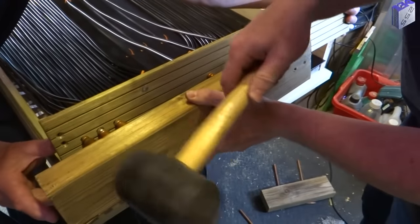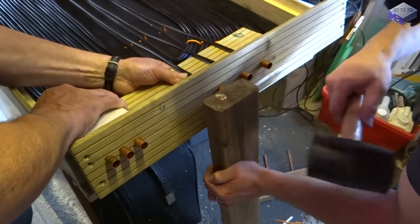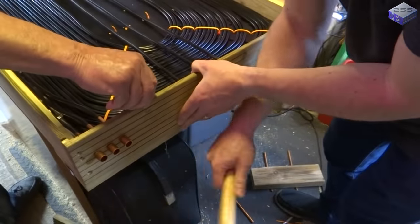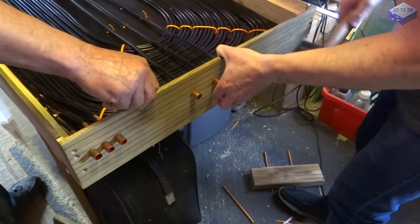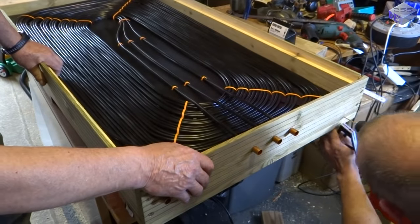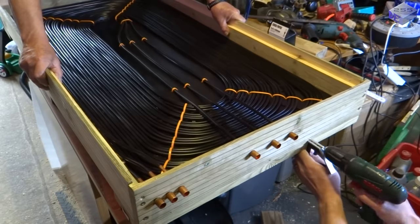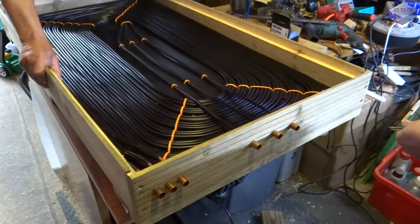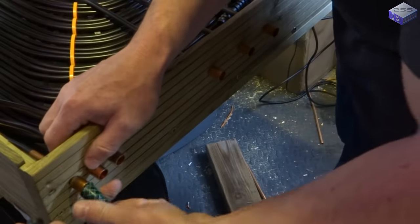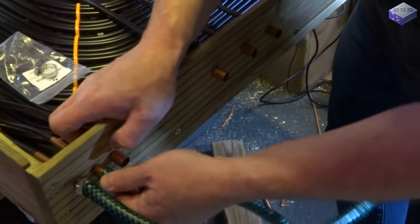Then hammering them into the wood. They worked out quite well, to be fair. Top tip, when you're drilling, use the edge of a set square to get your drill bit at 90 degrees to the plane that you're drilling into. And then standard hose pipe fits quite nicely over the top, just with a Jubilee clip to ensure it doesn't fall off.